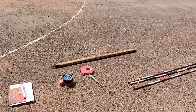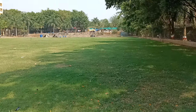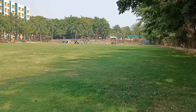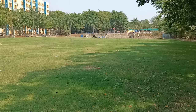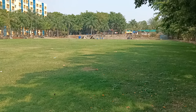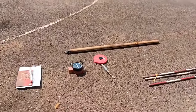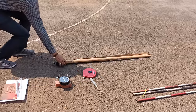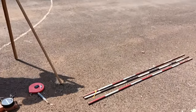Today is the first practical which we are going to deal with: the prismatic compass. This will not be a plain ground but a very undulating ground; the station points are visible. You are able to draw a triangle for three stations A, B, C which cover the area you want to survey. For a prismatic compass you need the following instruments: the prismatic compass, tripod stand (three legs), 30-meter tape, three pegs, and ranging rods.